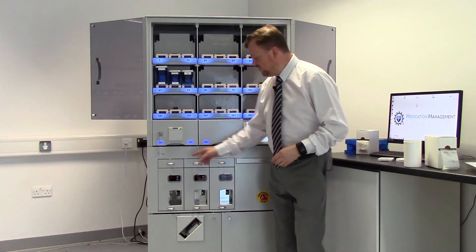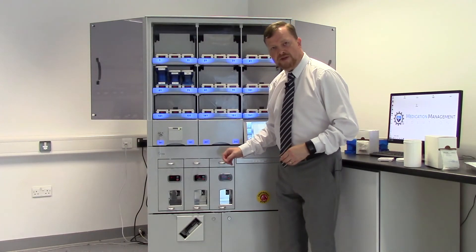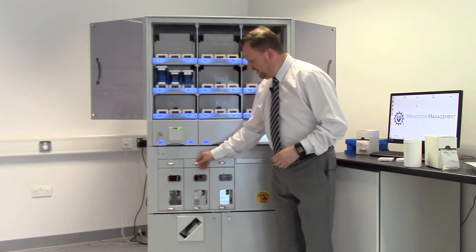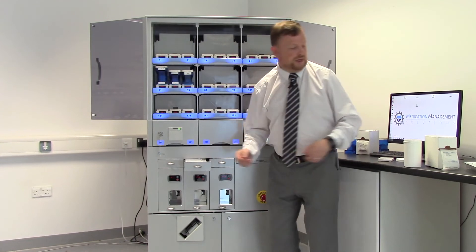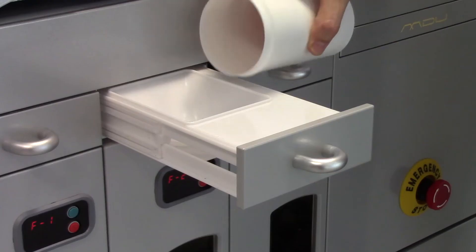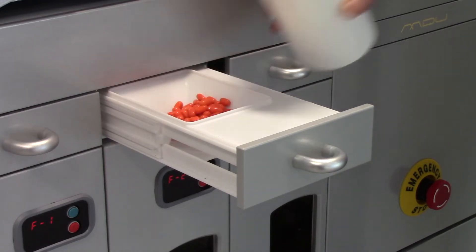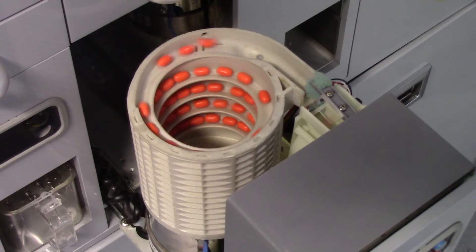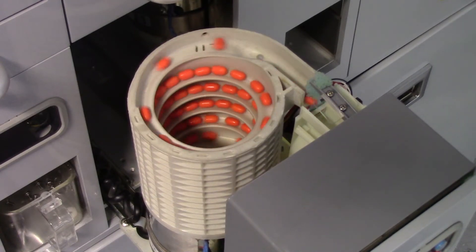A pouch pack has three FSPs. FSPs are for uncalibrated medication which is not on the top of the machine. What we can do is, on request of the machine, we can add medication to the FSP and then we're dropping it into the pouch at the right time within this machine cycle.